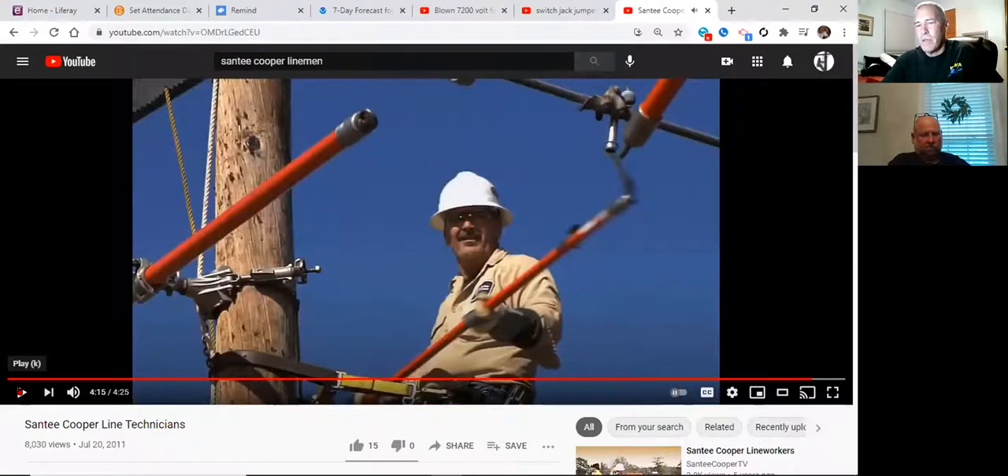We were talking about short sticking. I know this guy — he's been working in transmission for many years and really knows his business. To use this wrench and get control of this trunnion, to take this piece of equipment off with this ratchet tool, you kind of get a little bit close. But the more you move your hand up the stick, do you lose insulation? Remember, he's wearing leather gloves. What's the rating of the stick, Scott? 100 kV per foot.